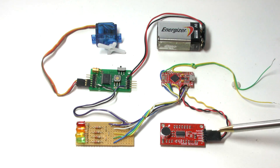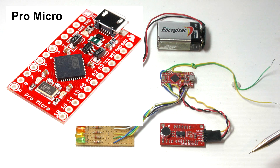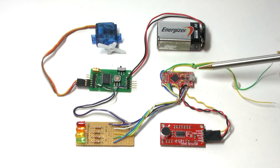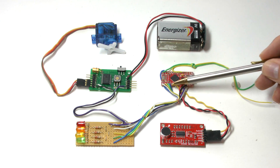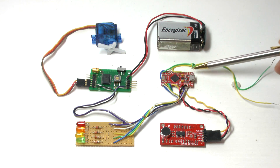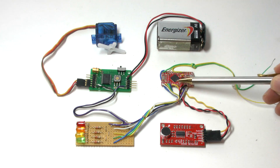The envelope signal is then fed to one of the analog inputs of a Pro Micro, which is also from Sparkfun — it's an Arduino-based board. We chose this one because it's easy to program directly via USB, it runs at five volts, and has analog inputs and plenty of I/O pins. The Pro Micro processes the envelope signal and tries to identify when apogee happens.